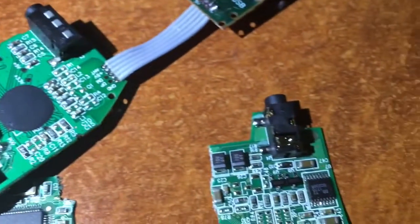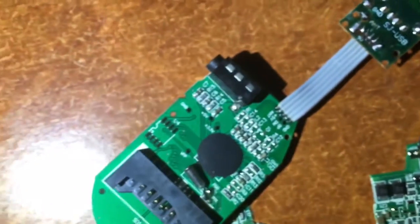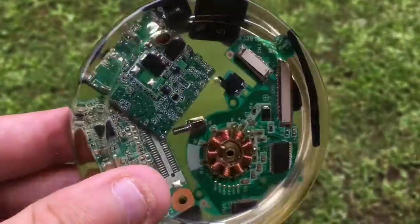I need a 3.5mm stereo socket for my new board, so I might as well just grab the best one of these. I've got a couple of QFP breakout boards on the way — if they help, I'll have to mount components closer to the pads that they're leading out, but we'll see. It's also possible to just dead bug it and set stuff in resin.